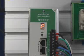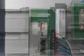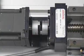In this setup, we're using an EP programmable drive to position a Lintec 100 series ball screw slide. The drive is wired so the enable signal is applied on power-up and the program will run after the drive is enabled.